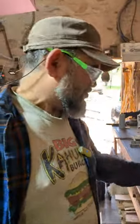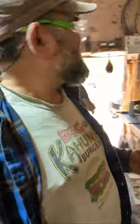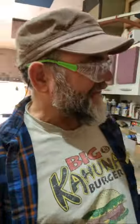Put both of these there. These are the little hangers you put on the kitchen units, but I don't use them because they're rubbish. I'll put these in the electric shed. What I did was put extra bits of wood right across the back, screw them all in place and then stick things through that, because that way I can guarantee I'm getting it level. So it's not as an individual thing, they're held in place as a whole, as an entirety. And that seems to work.